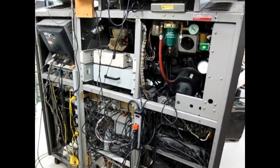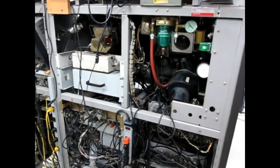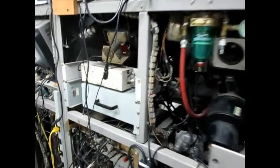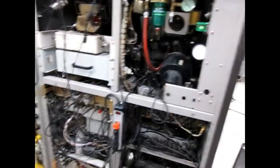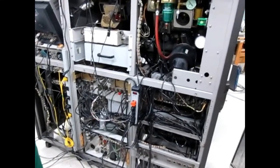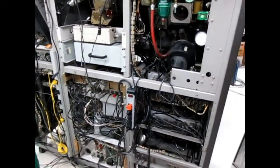First I would disconnect all the power connections and take out the power supply tub. Then I would remove the front control panel, and then unscrew all the coaxes and remove them and just lay them over to the side, because we'll put them back. Then it'll be cleaned out enough to where you can work the wiring harness out of the frame. So I would do the power supply tub first, then the front control panel, then all the coaxes. Okay. And then the harness swap.